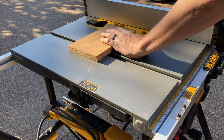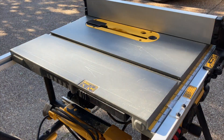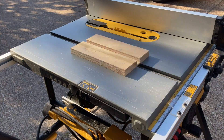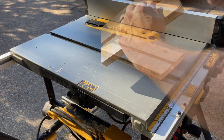So what I'm doing is I've got my table saw and a piece of three-quarter inch plywood. I'm just going to cut a channel that's big enough to fit a soldering iron. I don't have a dado set, so I'm just going through and making several passes and then taking a chisel to create a clean channel.